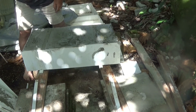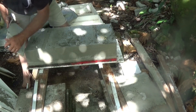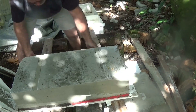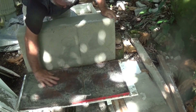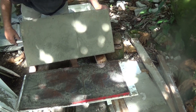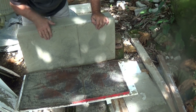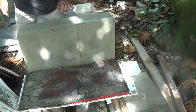The oiled one came out a little better. The oil made a difference — it came off pretty nice. So I'm going to say oiling is still a thing. See the difference? It sticks in that far on the non-oiled one, and on the front the top is definitely hard. So the hard facing worked and it did take the impression well. I'm going to say hard facing is a success. This is now officially a thing.